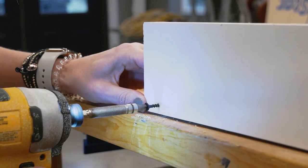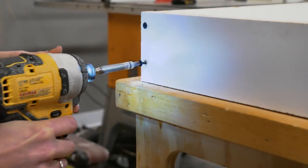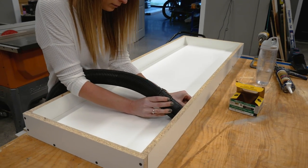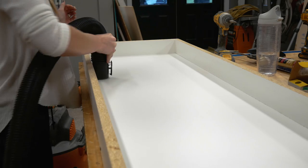Now to assemble the form, we're gonna wanna use 1 5/8 inch screws. I use drywall screws, but any type of wood screw would work just fine. But before you can assemble that, you're gonna need to pre-drill those holes. Space those holes about anywhere from 6 to 8 inches apart, and then make sure you have at least 2 screws at each upright joint.